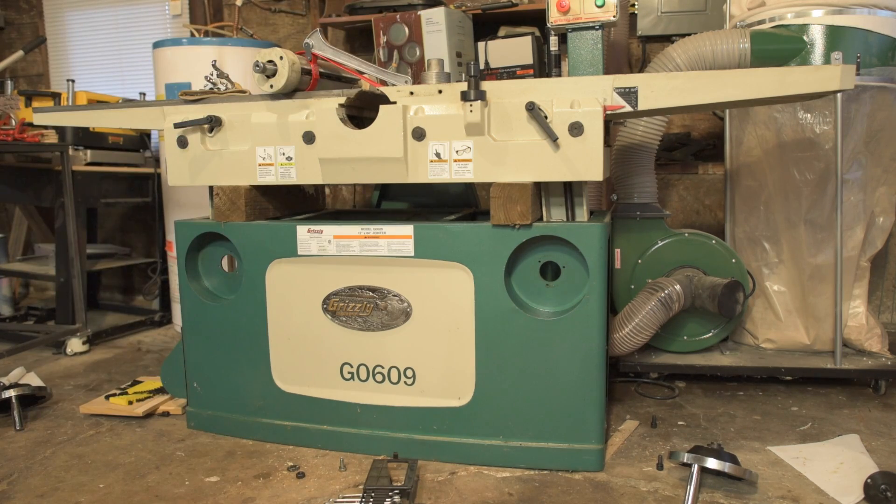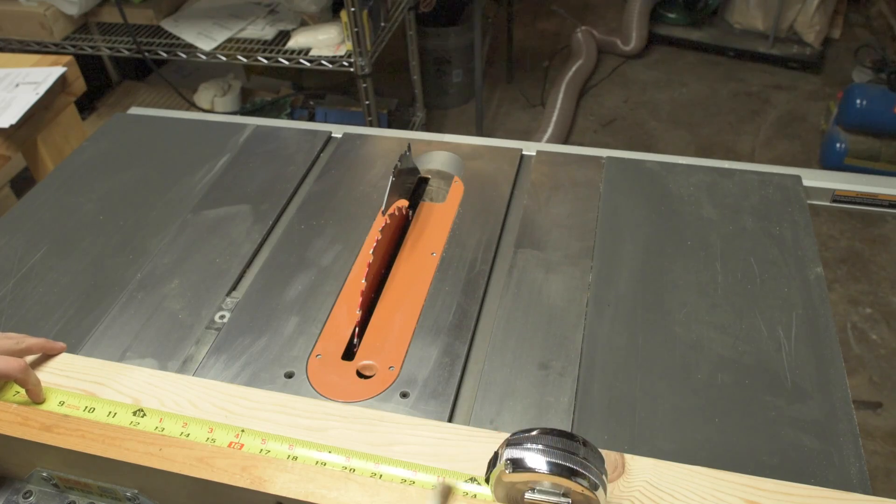Step 22: place the cutter head in an arbor press, insert a metal rod between the press and the cutter head shaft, and place metal plates between the cutter head and the rear bearing block as shown in figure 13. Have an assistant hold the cutter head so it does not suddenly drop, then press the cutter head shaft off the rear bearing block. The bearing block itself is about an inch and three quarters in thickness — a little less than that.